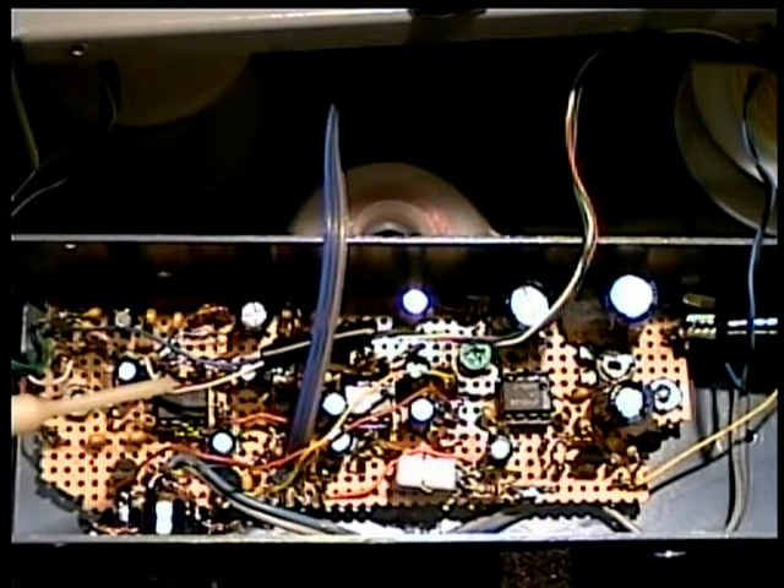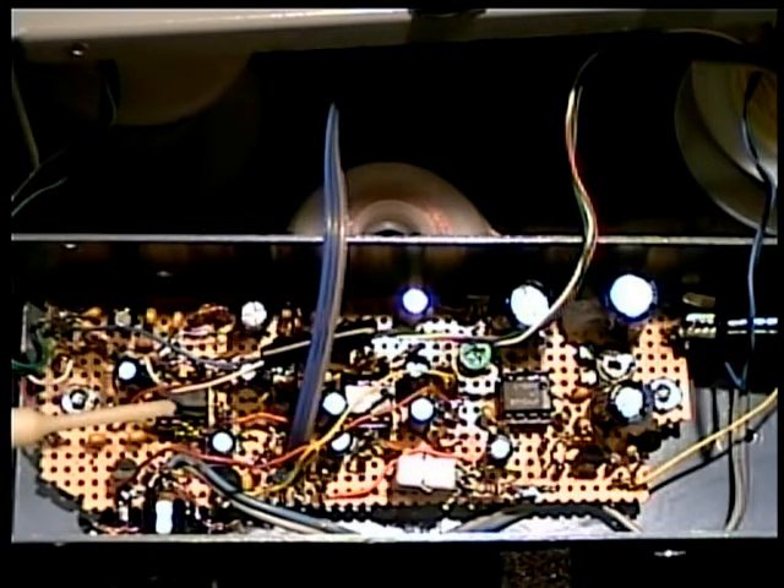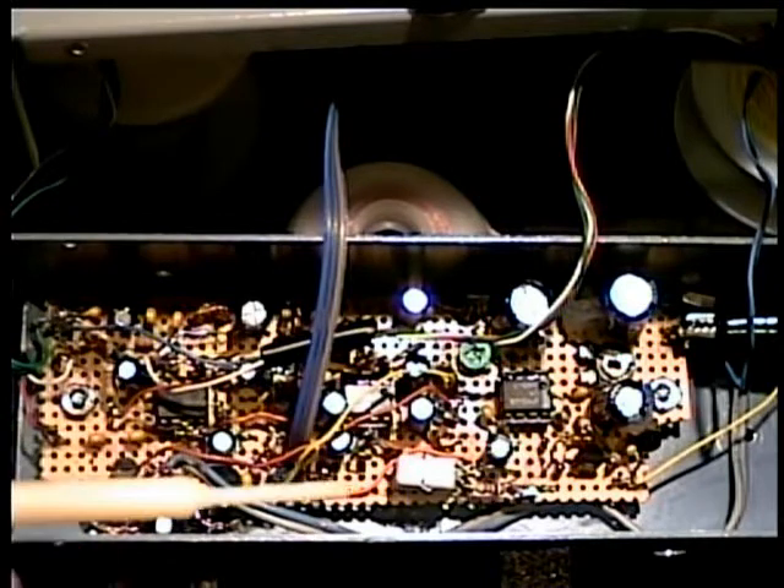The first IC is a variable gain amplifier. I'm using a pair of transistors as DC-controlled variable resistors in the feedback loop, and that gives a gain of unity — one-to-one — up to one hundred. That allows me to adjust sensitivity for different types of operation, because I'm trying to get this to handle everything from a human voice at 30 feet to a loud church service or even a quiet rock concert.